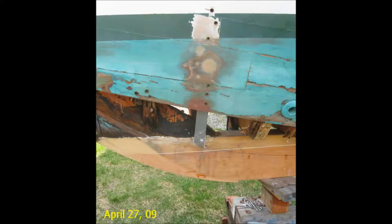Here's the first frame end installed in the boat. You can see where I removed fasteners going up to get the old wood out and then put the new frame end in. It's attached to the keel simply with a screw, but because I didn't really trust the screw to hold it that well, I also glued it on with 3M 5200.